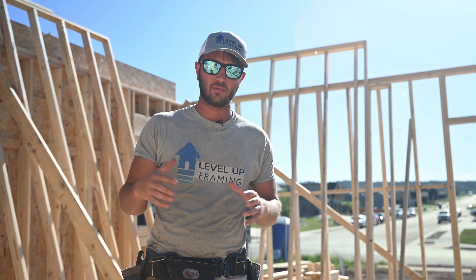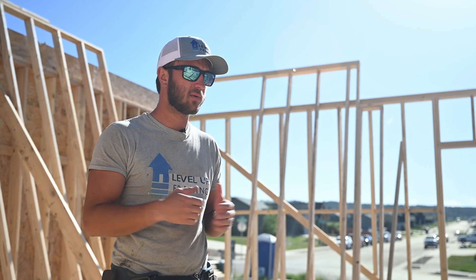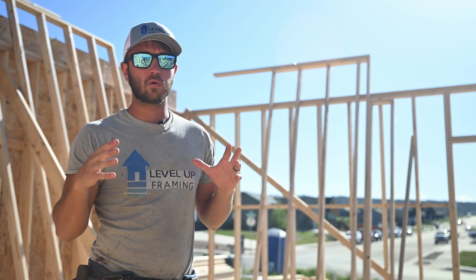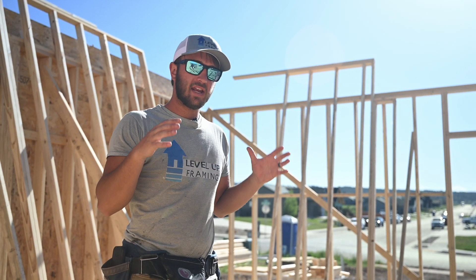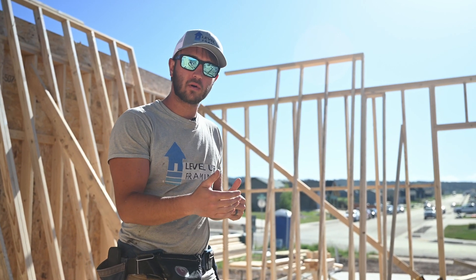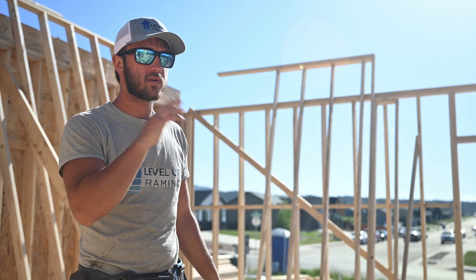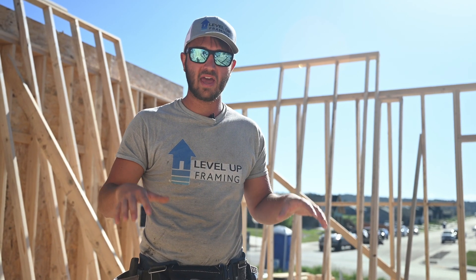Hopefully you got a lot of value out of this video. We covered different ways of standing walls and things to be aware of. For plumbing walls, you need to go off your bottom plate to your top plate, not the studs. Our tolerances for plumbing walls are a quarter inch on every wall and an eighth inch on any wall that is getting cabinets or tile — though we try to get everything perfect. If we're more than a quarter inch of lean, we'll spend hours tearing apart everything to get it within tolerances. And lastly, we covered a bunch of different ways of bracing — always brace it well, don't let your walls wobble, and make sure it will last through a heavy-duty windstorm.